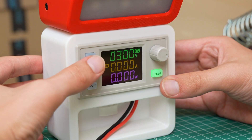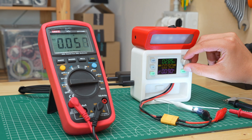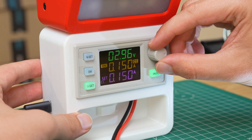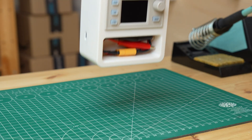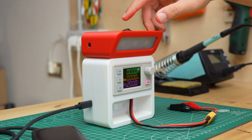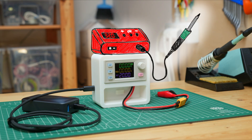The power supply itself works well and the voltage regulation is very accurate, while there is a deviation of a few milliamps in the current, which is acceptable for such a cheap circuit. The opening at the front allows us to store the cables and secure them with a velcro strap, making it very convenient to transport. The magnetic connectors allow us to create other modules in addition to the lamp, such as a fume extractor for soldering or even an entire soldering station. This power supply will always be with me during repairs on the go, and if you want to build it yourself you can find all the files to 3D print in the description below.